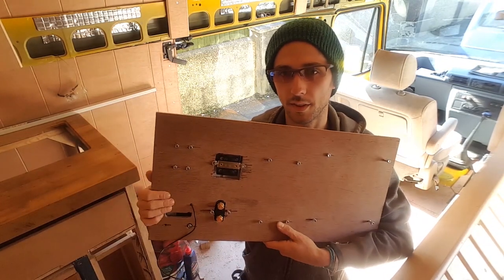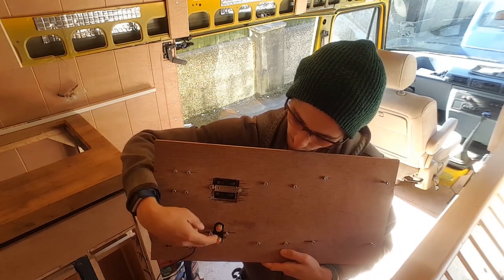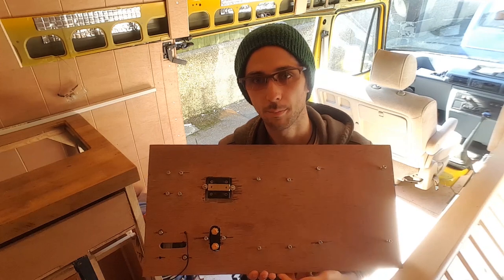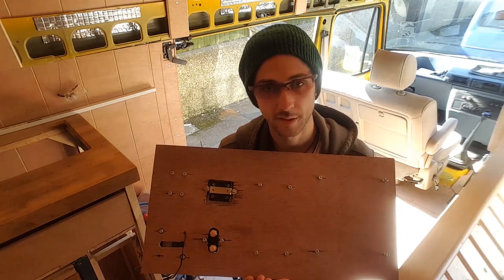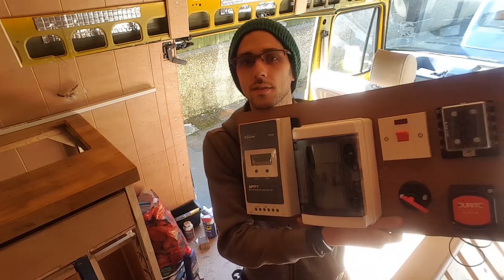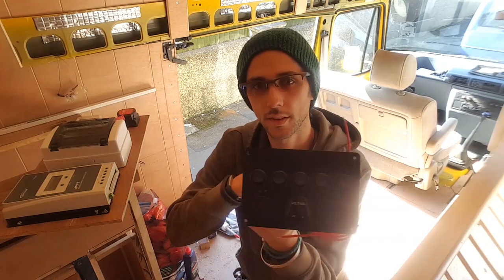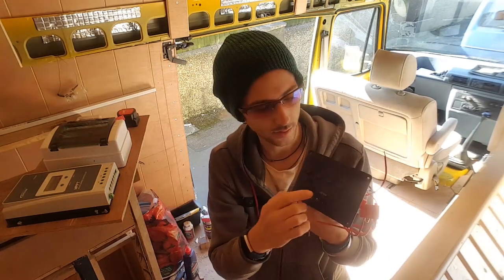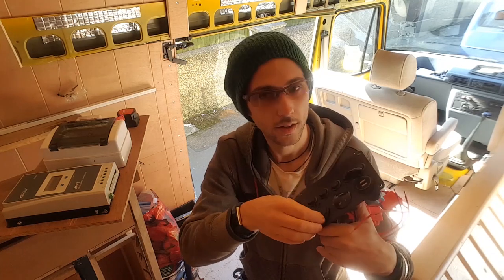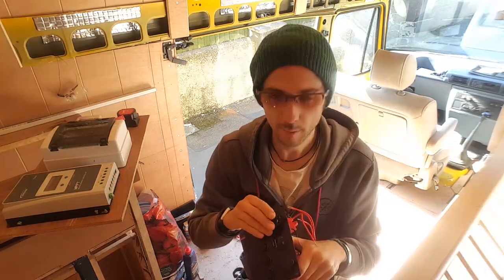It's not wired up yet, but essentially the back becomes the area where all the wires come out. I've got a bay to put the wire in for the relay, and I'm going to cut another bay for the solar wires. On the front inside, we have access to all the controls. The switchboard lets you add stickers, turn things off individually, has two USB chargers, a 12-volt lead, and a battery readout.